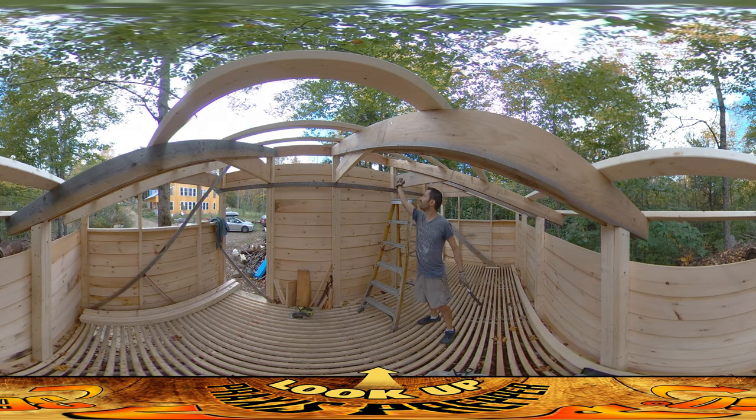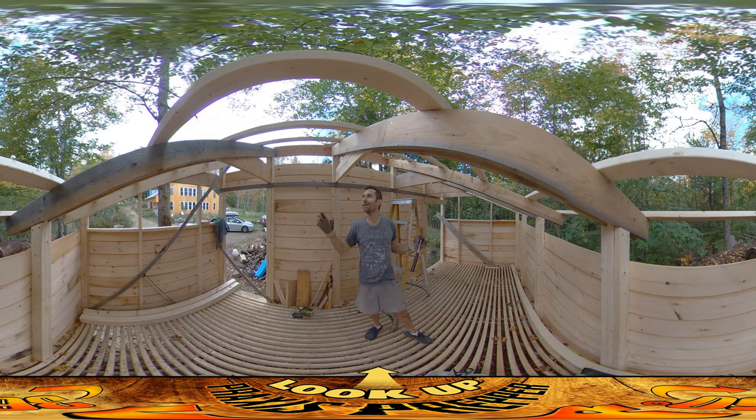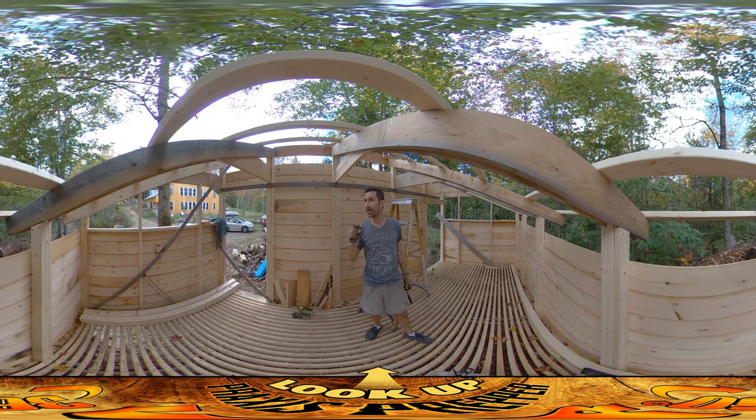It's going pretty smooth. Once I finish up with that, I'm just going to use my wonderful mathematics with the Pythagorean theorem and figure out how to get the roof to be a perfect rectangle, or at least as perfect as I'm capable of creating. The intent as this thing was built was to keep it rectangular, but there are little variations that get introduced. So before I put the roof on, I want to make sure I've got it as closely as I can to a perfectly rectangular platform. Then I'm just going to put some pieces on the side to hold all these together. I don't know if I'm going to get the roof on today but I will get it on tomorrow, and the day after tomorrow it's supposed to rain — so that'll be a nice first test. Thanks for watching.